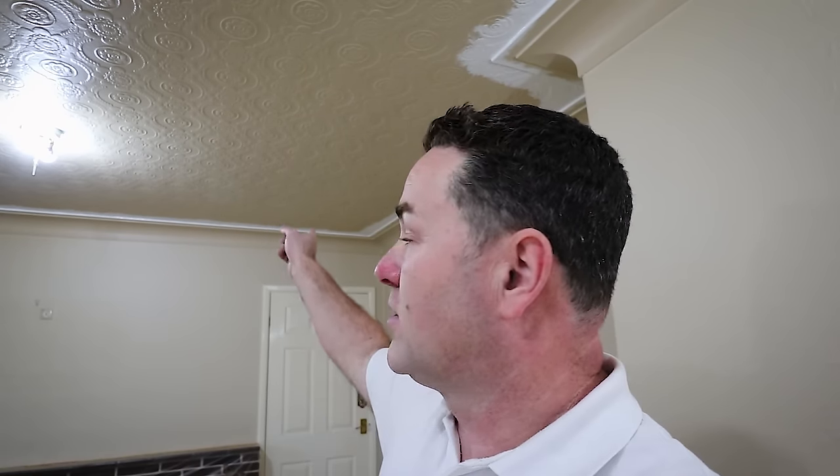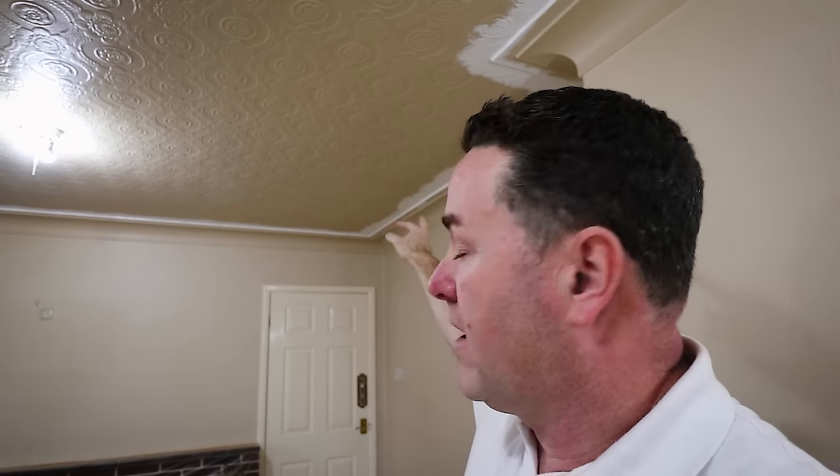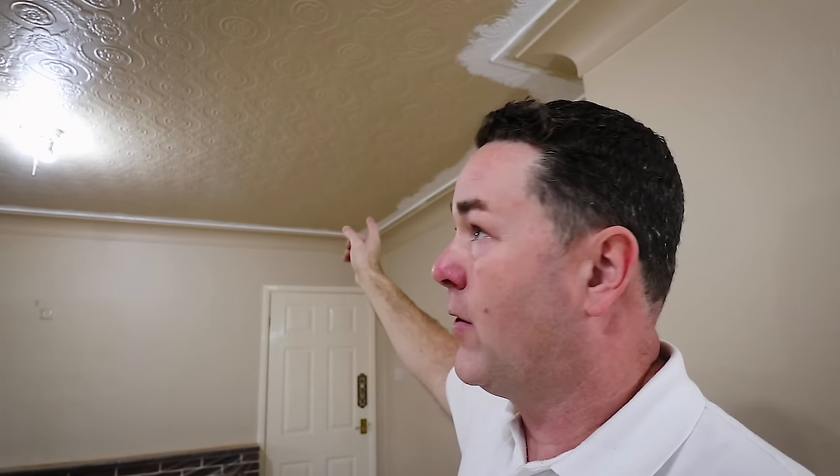About ten minutes to cut this room in. I've cut it in and coming back to join up where I started, you could actually feel the first lot of cutting was starting to dry off - you could feather it back into itself. I'm going to start in this corner so the camera doesn't get any spots of paint. I'll do a square and then bring the camera in to see what the opacity and coverage is like going over a nicotined, heat-stained ceiling. The roller is nicely bedded in, soaked into the pile, and away I go.